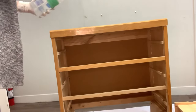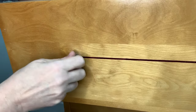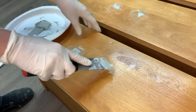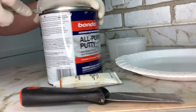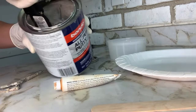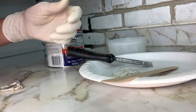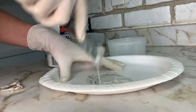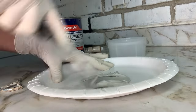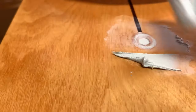To prepare this dresser for paint, I gave it a really good cleaning with White Lightening. Then I removed all the original hardware and filled the old hardware holes with Bondo. Bondo is super durable — I can actually drill through it if I'm going to be putting in new hardware holes. It dries really rock hard and it's ready to sand within 10 minutes, which is why I love using it. It's just such a time saver. I have a full tutorial on how to use Bondo and I'll include that in the description below.